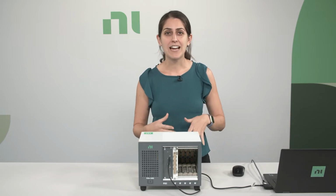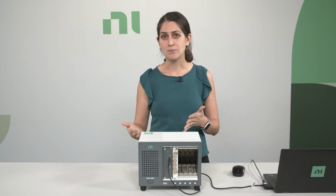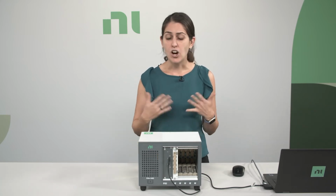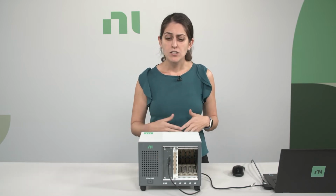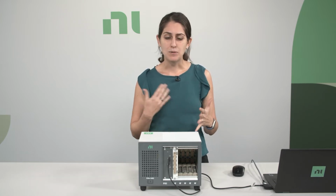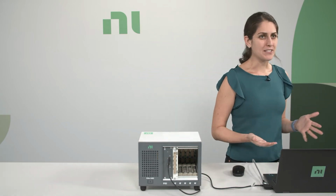The Nanovolt Meter gives you access to 8 simultaneously sampled differential channels at up to 2 megasamples per second per channel, or 32 single-ended multiplexed analog input channels at 100 kilosamples per second per channel. This module features onboard signal averaging and filtering, auto-zero measurement switching, and a chopping mode which uses a pair of channels to provide a high level of noise rejection, enabling accurate and repeatable nanovolt measurements. Thus the name.